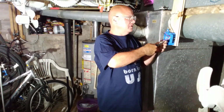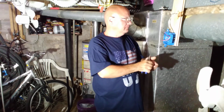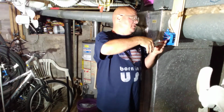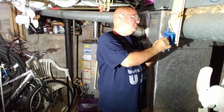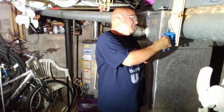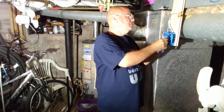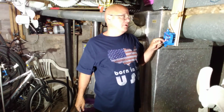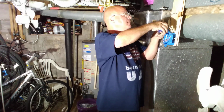So first, we'll get our ground wires together. You want to make sure your wires are all nice and straight when they go into those push-in connectors. There's one, 2, and here's 3. Okay, since our red and whites are the travelers, they'll be going on the switch, and the 2 black wires we'll put together. So we want to make sure we have our wires even.